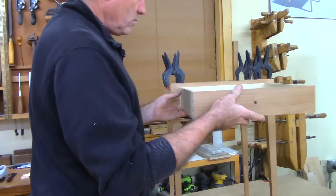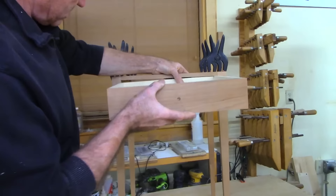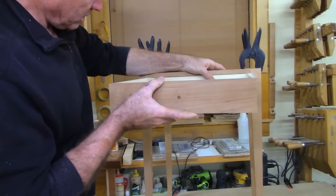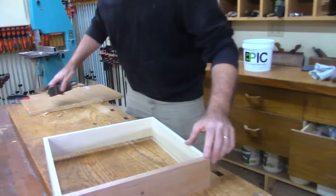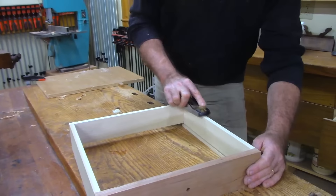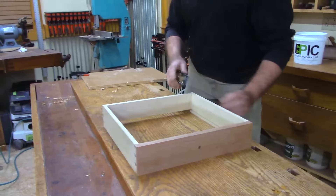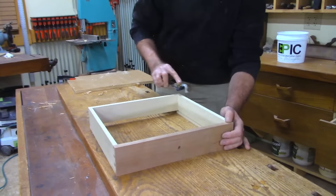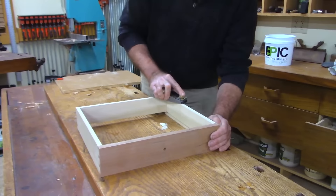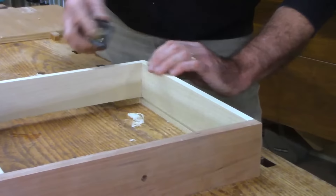On the sides, negligible — it's not expanding and contracting along the opening. Let's see how it fits. Something's binding — it's a little high, I'm binding on the top right over here. I can feel it's high. I'm going to skim that off. My side is actually a little proud here and here, so I'll address that with a block plane. Take it easy so you don't overshoot the front.